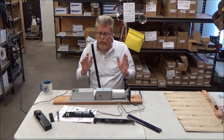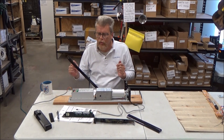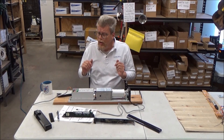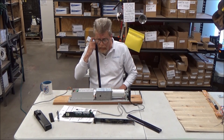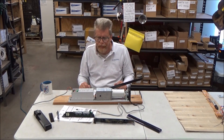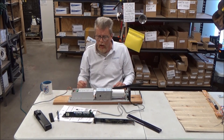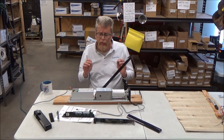When you first fire up you want the door to close — open it halfway and this side will be your door-closed position. It goes immediately to the closed position. I've triggered the door to open — first cycle slow, keep that in mind. Now when it comes to close, I'm going to activate the safety and it backs up.